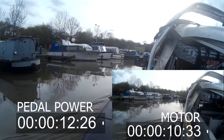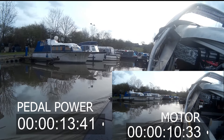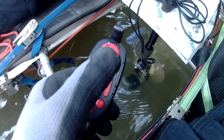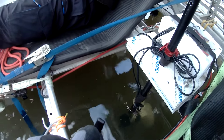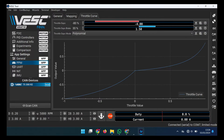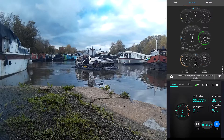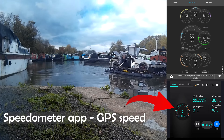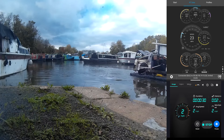The results weren't too bad for an initial setup, but I needed to go back to the VESC tool and change some settings for the battery and motor so the speed controller would put more power into the motor. The default throttle curve on the VESC tool is just straight, which means you get instant power straight to the motor with no real control. You want it to be a lot smoother so that as you touch the throttle it builds up gently. This updated throttle curve should achieve that. Similarly, the speed calibration was completely off — it was reading 22 miles per hour, which is definitely not right, so we changed settings to get it closer to the real speed.